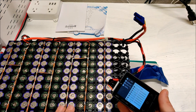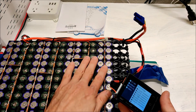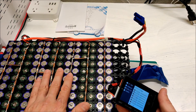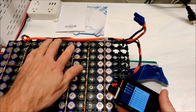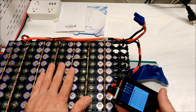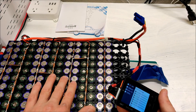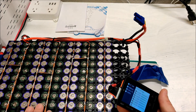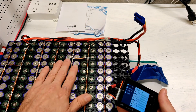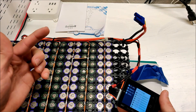The problem is this is one of my original designs where I soldered the individual fuse legs on. These days I do a lot of spot welding and I probably would have spot welded this. So to find those self-discharging cells, I'm probably going to have to go and cut all the fuses on packs three and four, let these cells sit for a few days, and check back to see if any individual batteries have drifted.